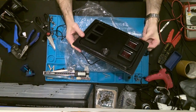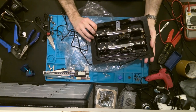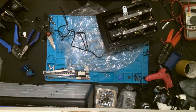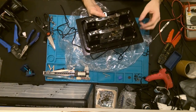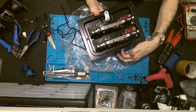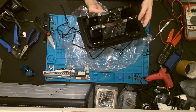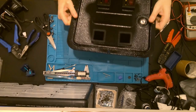These doors come with brackets on the inside that allow you to bolt them onto the cabinet itself. However, those brackets require a minimum half inch or even 5/8 of an inch thick material to bolt onto — they're actually intended for 3/4 inch material, which is the standard thickness of any arcade cabinet. If you try to bolt these onto a standard kick plate panel in an Arcade1Up cabinet, it will not work without some additional modifications.